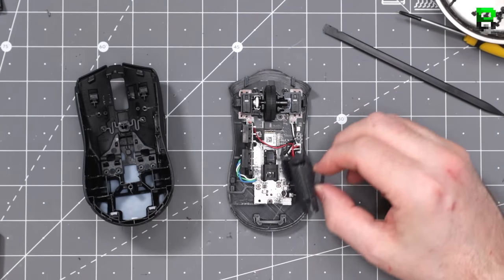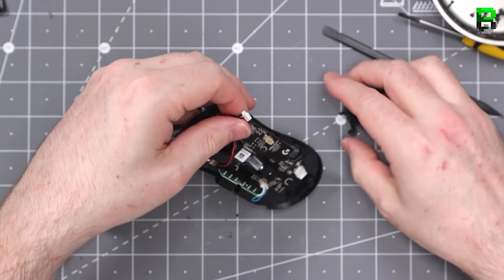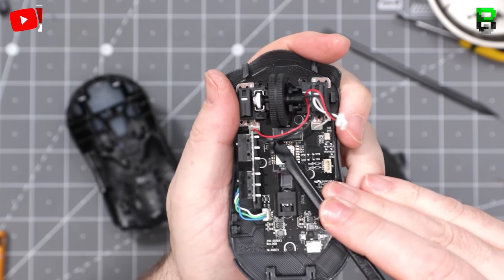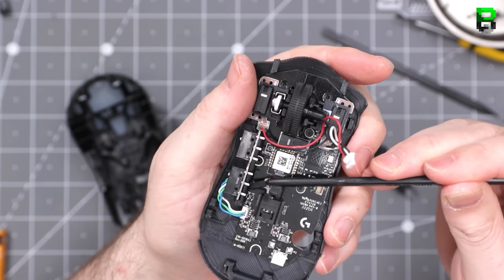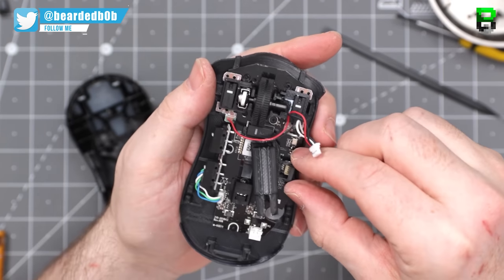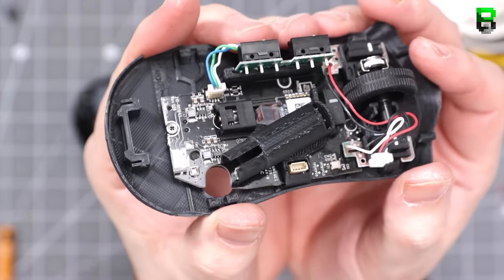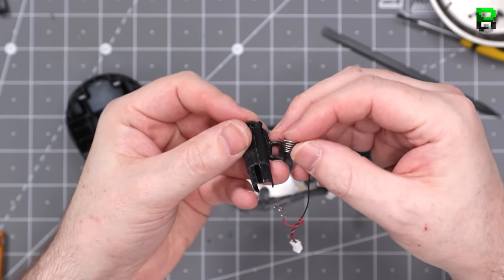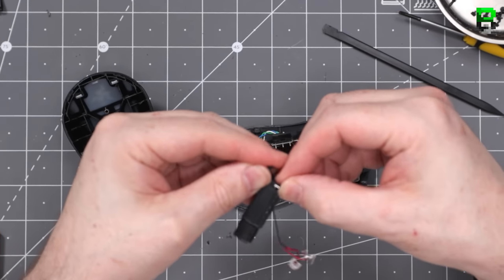Now the battery. This has a cool little battery mod from Zorcerus — it uses a triple A rechargeable USB battery. It holds nicely onto the DPI switch. There's a little bit of sponge on the LED that you need to pick off, as it restricts the battery holder from being put in place. You can glue it down if you want — I glue it to the DPI switch at the base. You can use the existing cable from the G305 battery; just push the rear spring one in. You're going to have to solder the other one onto the front of the triple A battery.